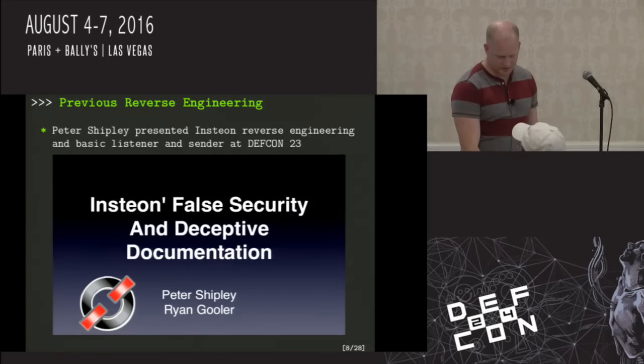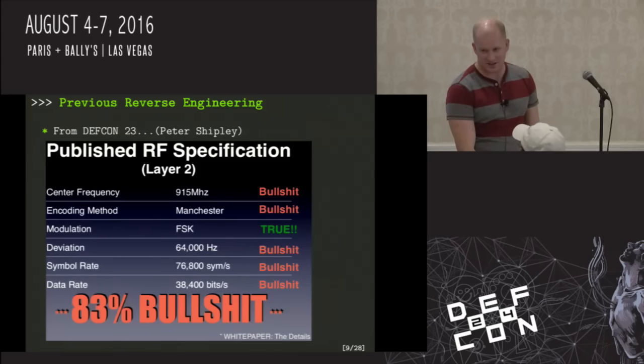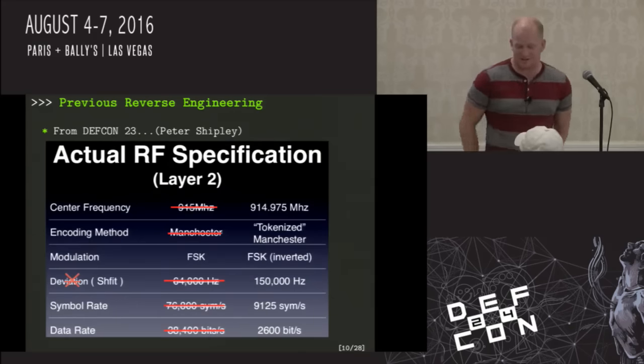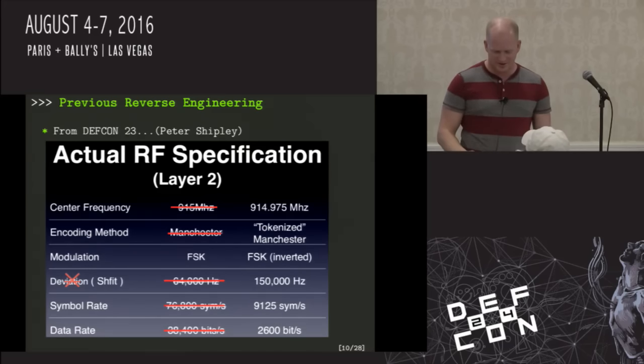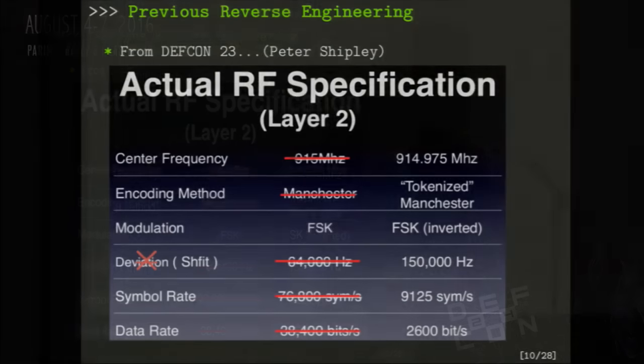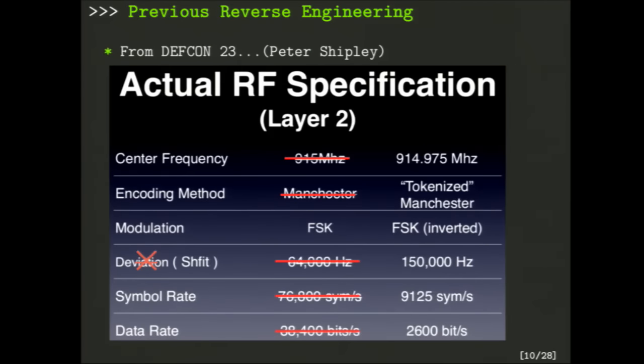Everybody remember this? Everybody seen this YouTube? It's a great one. He was like mad at Insteon. Insteon lied to him personally about his documentation. Bullshit, he said. Not 915, not really Manchester, all the deviations wrong. It's great. Here's what he said, 915 is just tuned down just a little bit. Tokenized Manchester is not really just, you know, 1-0 is not really a 1, 0-1 is not really 0, whatever. FSK is inverted, all this stuff, okay? He was angry.